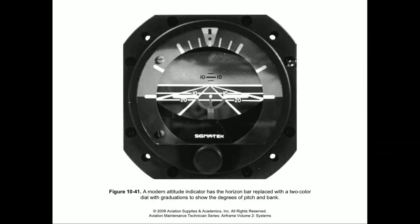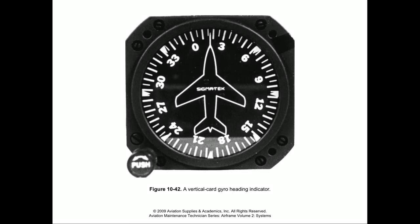This is an example commonly installed in small aircraft all the way up to large aircraft as a backup gyro system. Many aircraft now incorporate glass cockpits, but traditional gauges like this are still used as a backup in the event of a glass cockpit failure. There's also an adjustment knob that, when the aircraft is level, allows you to move the miniature airplane indicator up and down to match with the horizon. For the attitude indicator, it detects movement about the longitudinal and lateral axes — so we're looking at pitch and roll. The vertical card heading indicator only detects movement about the vertical axis, so we're looking at yaw to see changes in aircraft heading.